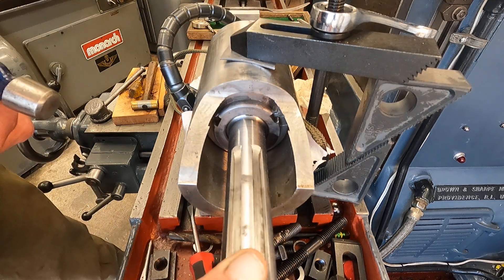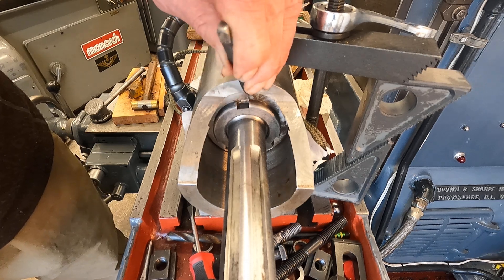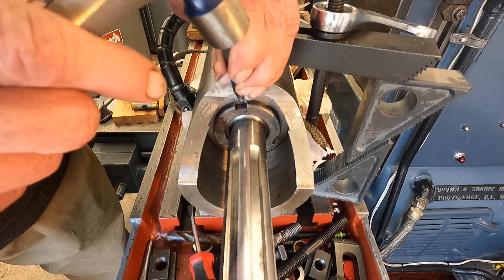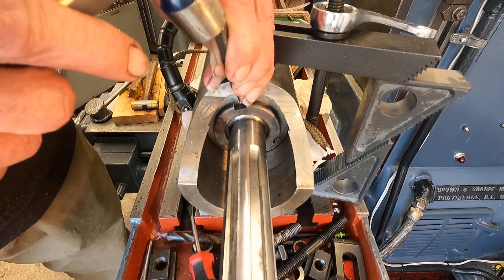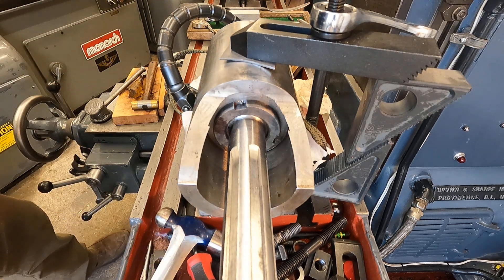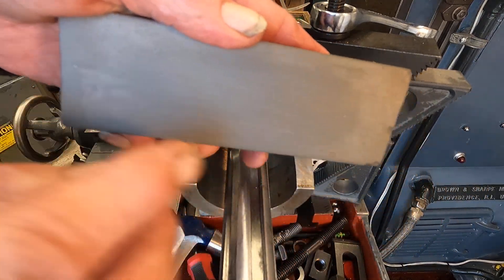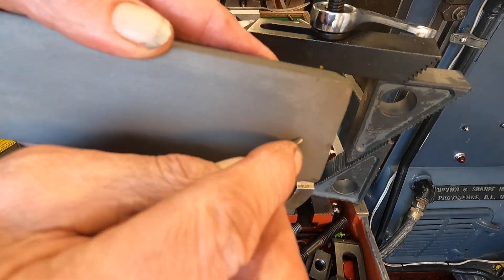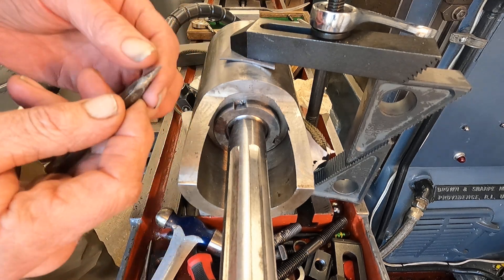Looking pretty good. Now I'm going to go to this side — it doesn't look like they punched it, but it's got a bit of a skid there. The next one has a punch mark. I'm going to do the same thing — get my edge on there. I can take that raised metal away with this little tiny micro chisel I made. Let me touch that up a little bit — there's my edge. Got to keep it sharp. That's all it took — it's sharp.